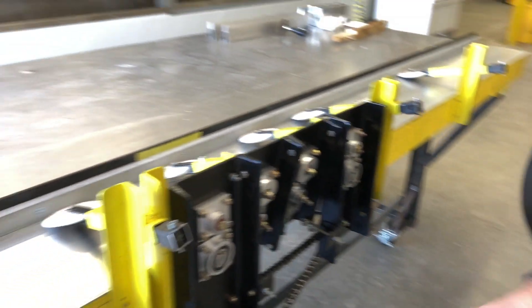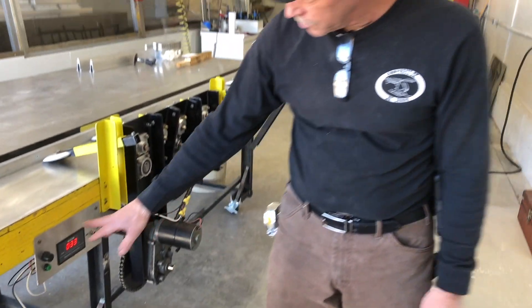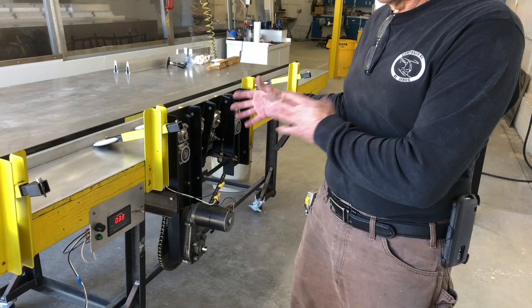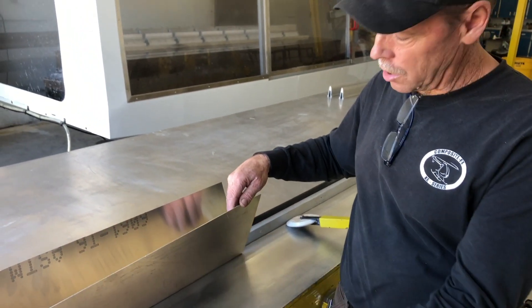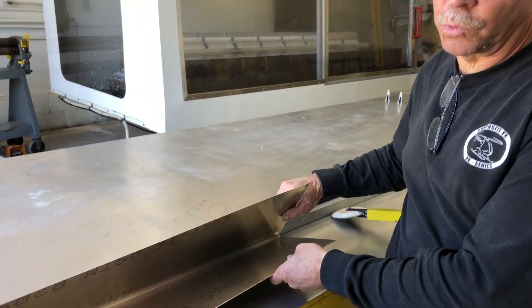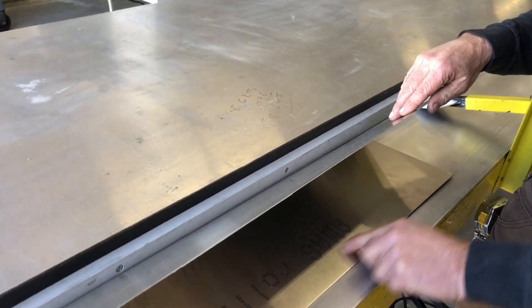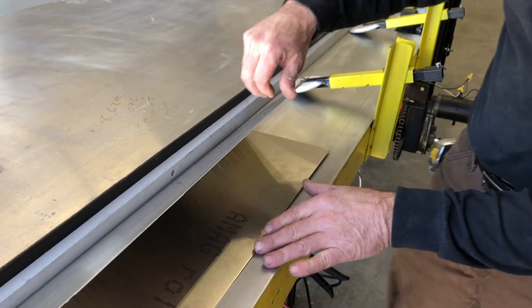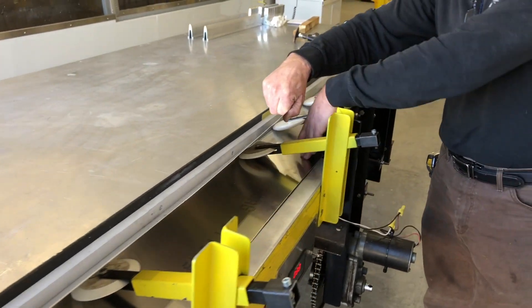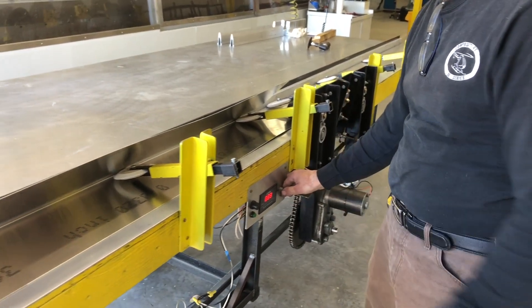This particular machine is driven off a DC motor and has much reduction to it. We also have a speed controller so we can control how fast it goes through — forward and in reverse. As you recall, the top side of the skin was marked A as it came out of the roll former. That's the side that goes down, because we want the reflex bent on that side only — this side folds into it, but this is the side that actually gets bent. So we load it in with that side down, feed it to the drive wheels, start the machine up, and roll form that reflex edge on there.